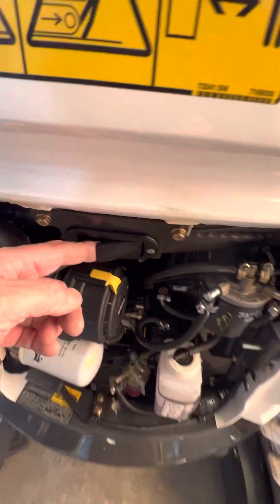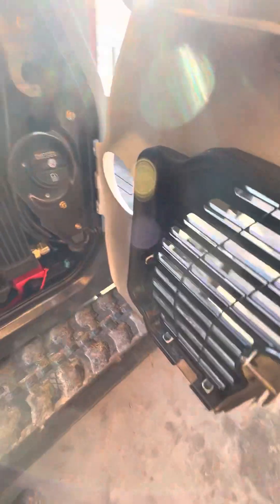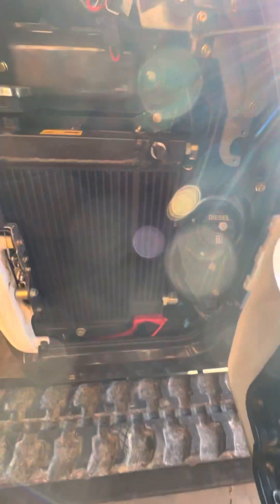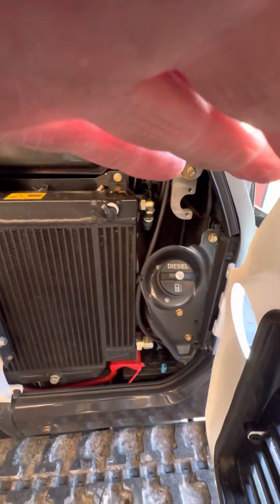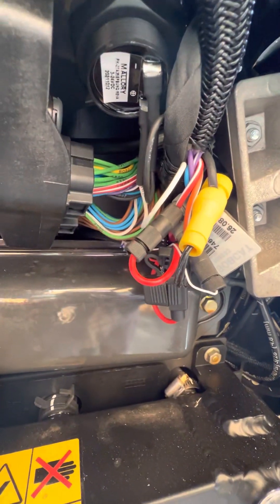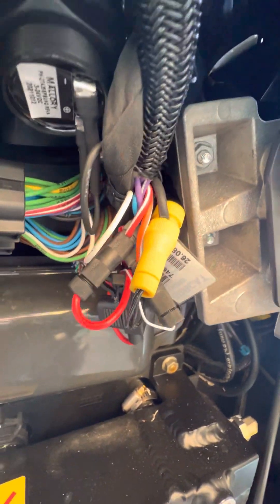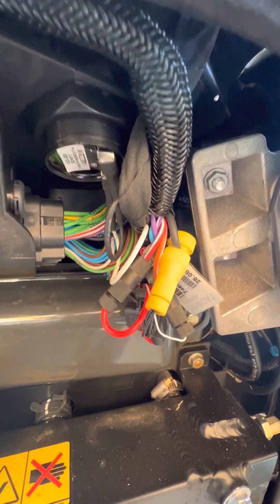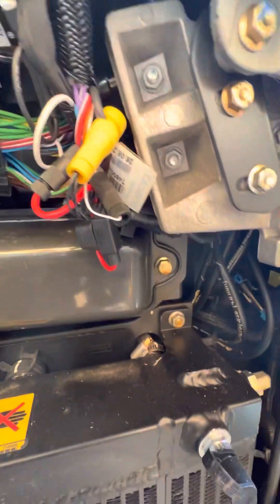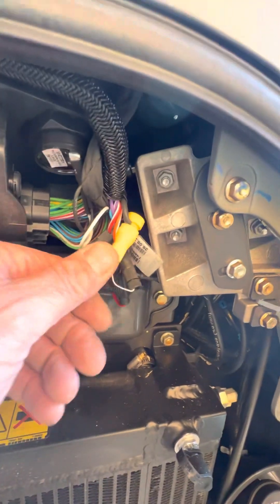I opened this up and there's a little switch right here. When you open that, it releases the side door — the machine access door. So we've got our engine in there, access to the fuel fill, and a telematics plug that's underneath here. It's a little bit hard to see but it's in there. It's supplied by Bobcat — it has ignition power and ground, and it was put in there for diagnostics and adding telematics.